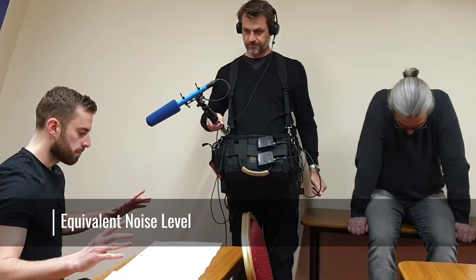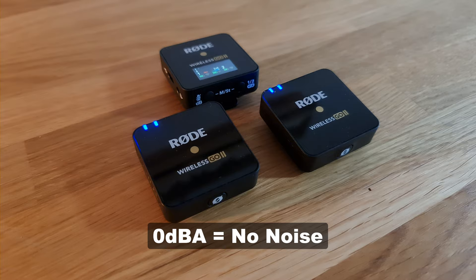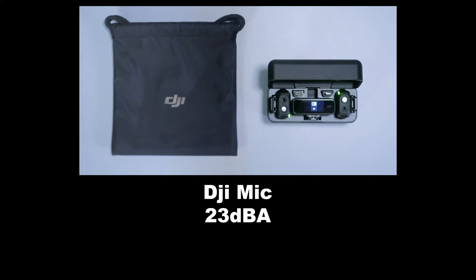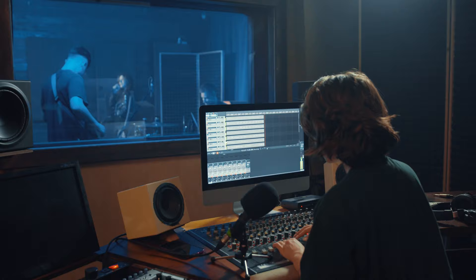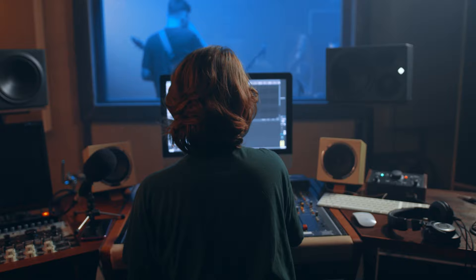When professionals buy microphones and other recording kit, one thing they look at is how much noise the unit produces itself — known as self-noise, measured in dB-A. An equivalent noise level of 0 dB-A would be no noise at all. This Rode setup has an equivalent noise level of 22 dB-A. For comparison, DJI's new wireless mic setup, which is considered a direct rival, has 23 dB-A — virtually the same. Compared to the very cheap wireless mics covered in another video, the Rode Wireless Go 2 is much quieter, though you'd expect that as this setup is about 10 times the price. A low equivalent noise level is particularly important in a studio situation. For social media or low-budget movies, 22 dB-A is good.